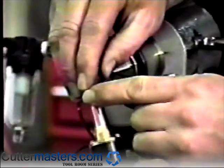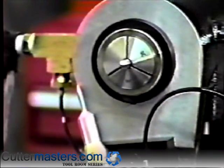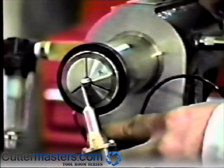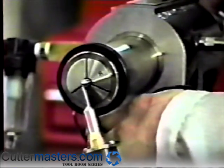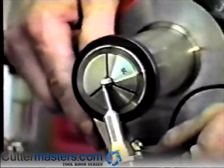If the carbide stylus happens to be too long, you'll need to grind the bottom of the stylus off to fit. You'll need to reposition the pneumatic finger bracket so that the stylus is directly under the point of the setting pin. Tighten the set screw for the stylus holder and tighten the stylus bracket screw.